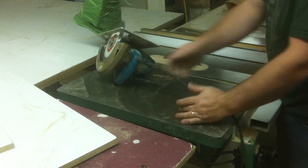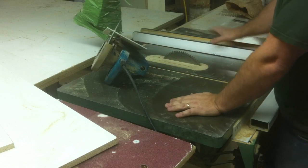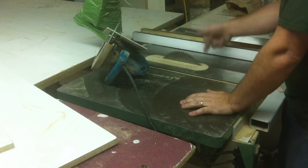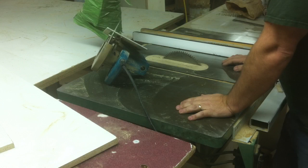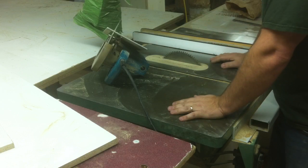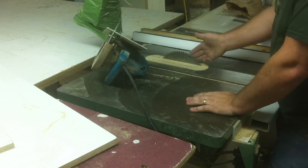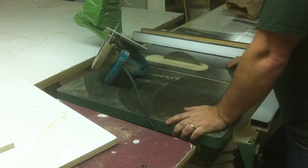If you've been following my videos, you'll have seen the drum sander build where I actually turned the drums using the table saw. I made a simple slide system that went back and forth, and by raising the blade I could change the diameter of the drum. It did an incredibly good job — I was just thoroughly impressed.